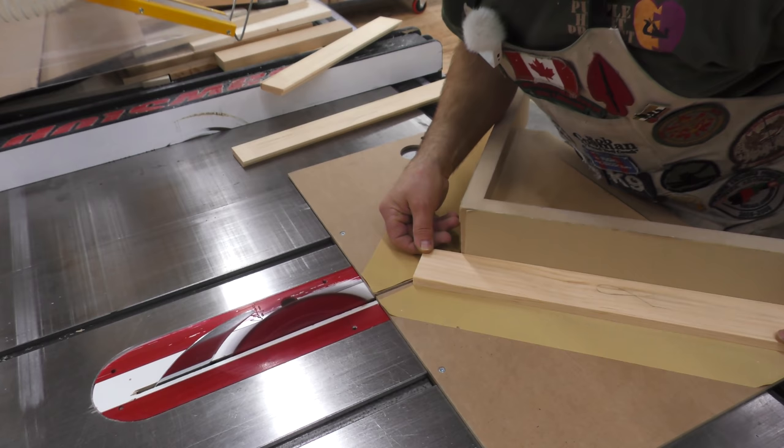Okay, so... That looks like a lot, but it's a very small amount on each of those. We could actually go in and just take a little bit off of there, but we'll make some notes. I'm just going to see what we can do as far as pulling it tight. So the inside corner lines up, and we open up just a little bit here. So what we need to do is go through and just make a few notes and decide, do we want to come in here and clean up a little bit, take a little bit of this off in order to tighten that up, or... We'd be better off if we went over here and just took a little bit. Where's my pencil? We just took a little bit off of this one and this one, just enough to close this gap, and then we don't have to mess with these. It's close enough that it'll still work for us.